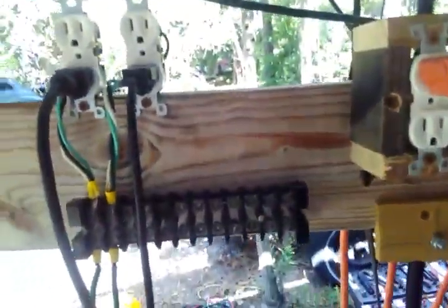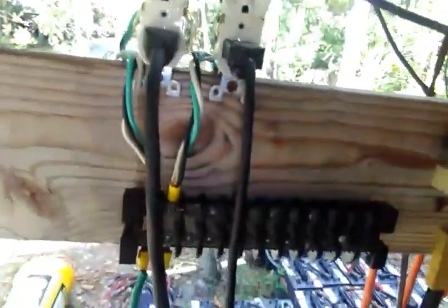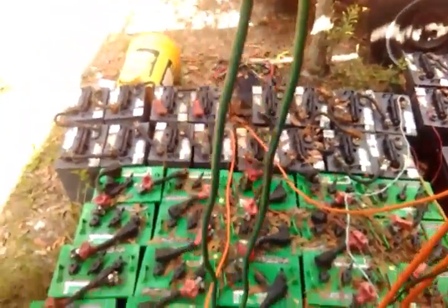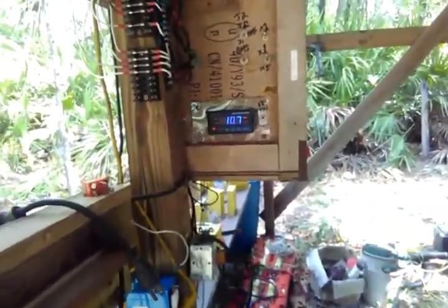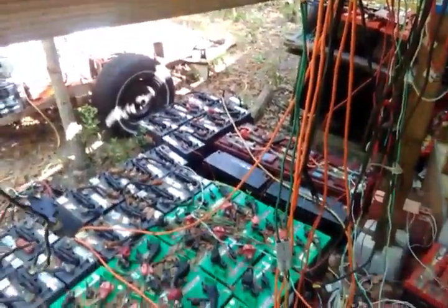That's my electric lawnmower. So yeah, this is not an automatic system, but it's done with almost no expense. Plugs are very cheap, and these cords you can get anywhere. I'm going to unplug this and go back to charging my 12 volt battery here. We're still getting 10 amps, so it's doing good. You got old batteries you want to keep charged up as a backup — when I'm not charging a car, I can be charging here. And that's our setup.